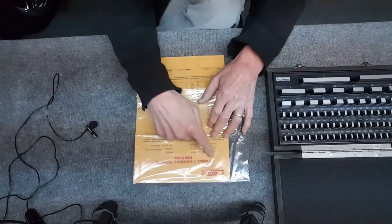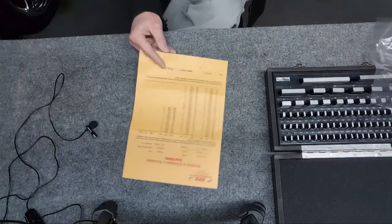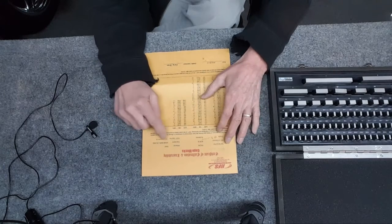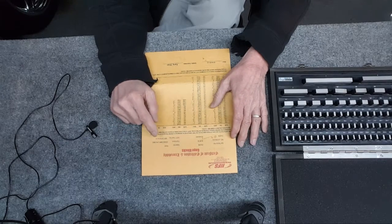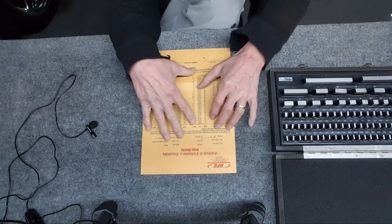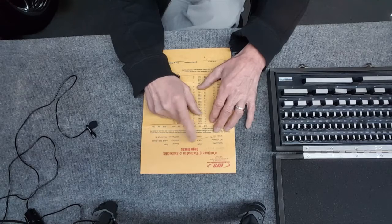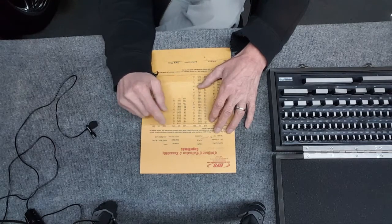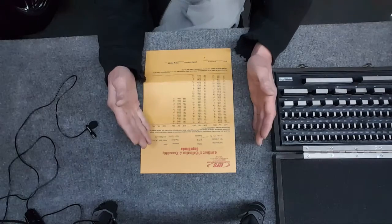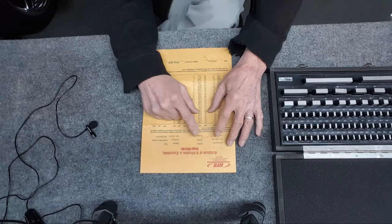Let me take you over to the bench and show you a little bit about the certificate. I pulled up the specification — there's one website which shows the table. For this certificate, it clearly states grade economy in the chart. It also says grade B, and grade B has sub-grades. So if you see something on the internet — a gauge block set for sale that says grade economy or grade B — it's the same thing.